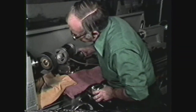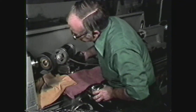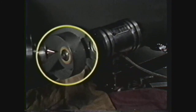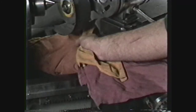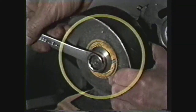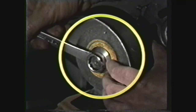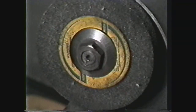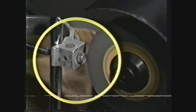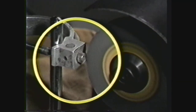Some of the safety precautions to be observed when using a tool post grinder on the lathe are: keep all guards in place when using the grinder; wipe the oil off the ways of the lathe and cover the ways with a damp cloth; properly mount the wheel on the tool post grinder; always operate the tool post grinder within the maximum safe speed range of the grinding wheel being used; and be careful during the dressing of the grinding wheel not to gouge the wheel into the dresser.